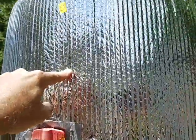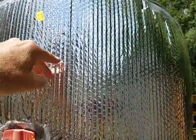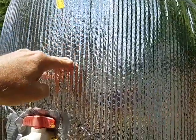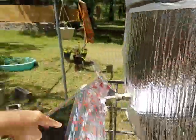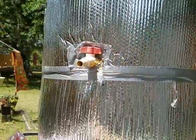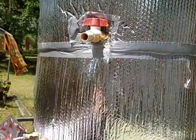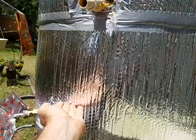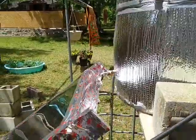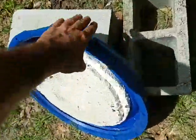It would probably have been prudent to place the hot water outlet a little higher. In a future design we'll take hot water out from a bit higher up — we just didn't want it so low that as the water level drops it lets air in. When you have two panels and the whole barrel is filled with hot water, the current placement is appropriate because even as you open up cold water, it's going to start coming in and pushing the hot water out because of the thermocline stratification. So it's working, and that's a good thing.